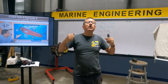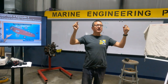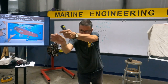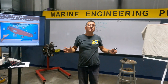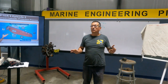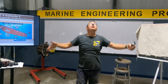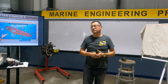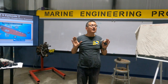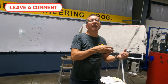Everything on my boat should be connected to the bonding conductor. Should the rail on the deck be connected? Yes — one of the bases of the rail should be connected with the bonding conductor. If not, during a storm it will be destroyed. The anchor, the tower — any metallic part on my boat should be connected to the bonding. It's clear the difference between bonding, grounding, and ground, and between current-carrying and non-current-carrying conductors.